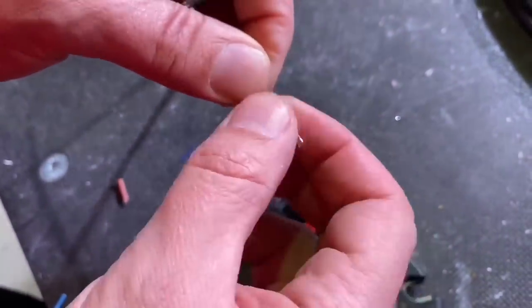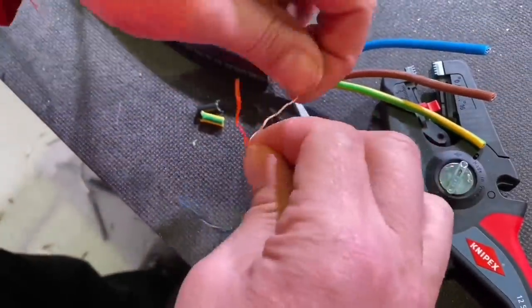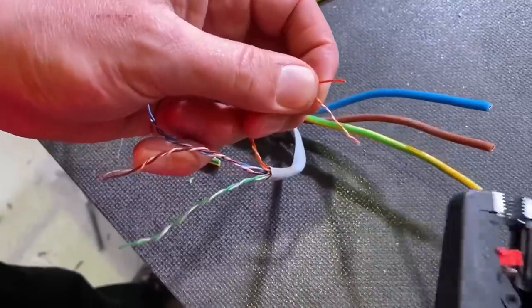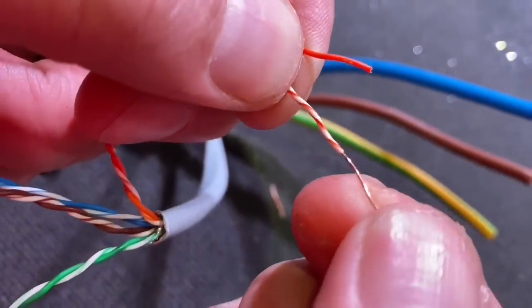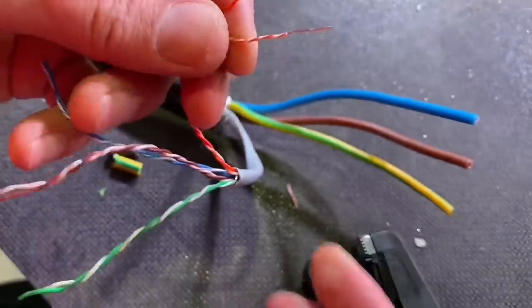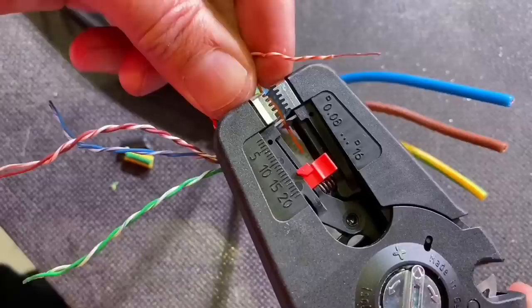If they are damaged, you can adjust it. Now this is a combined EV ultra cable — we've got a data cable in here and an XLPE armoured cable, so these are opposite ends of the spectrum. These are Cat5 and they're solid — no conductor damage. Easy to strip. That's just the benefit of not having to readjust the tool in order to strip such a variety of cable sizes. Nice slow motion there.